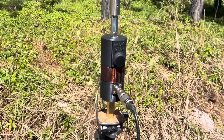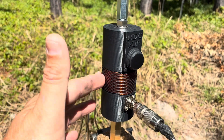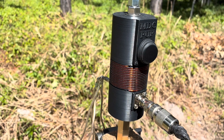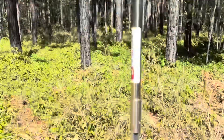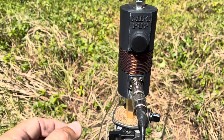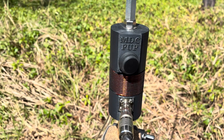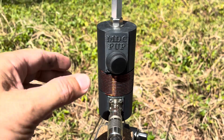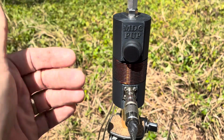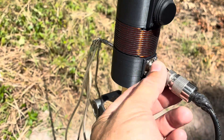So let's take a look. As you can see, the PUP here is 3D printed with a small amount of windings — just enough to bring in around about 9 microhenries of inductance for the 17 foot long whip. Now to bring in the 40 metre band, we've got an on and off switch here, so in the on position the coil is in series, and in the off position the coil is taken out.